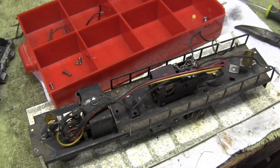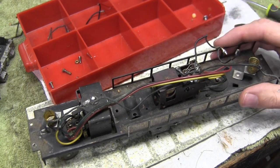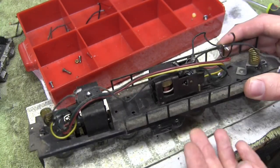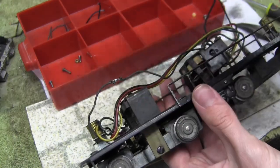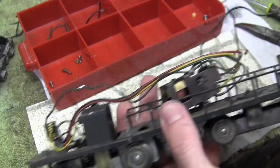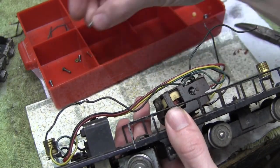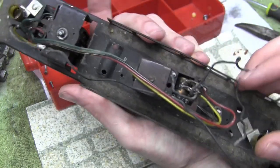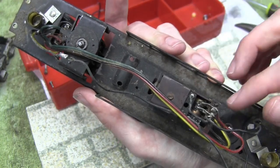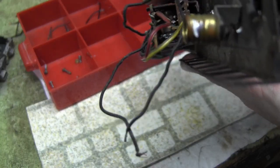Just want to show you a few things on this. Wiring is already a disaster. So I wasn't going to show you the restoration, but I do want to show you some unusual things that were done to this. A lot of the screws were replaced, including one of the screws for this was a bolt. And the screw holding in the reverse mechanism was this wood screw. So that's a potential cause for damage. Also, these two fingers on the top, I'm not sure if that's a piece of solder to reinforce those. And then one up on the bottom there.